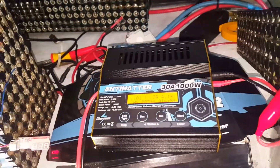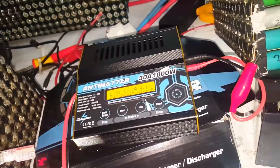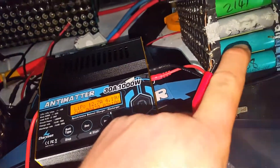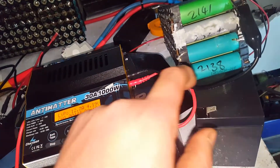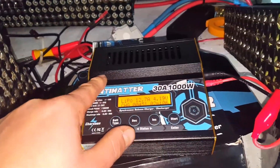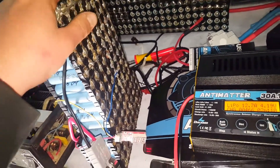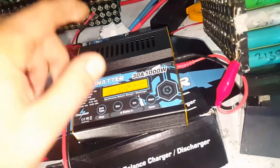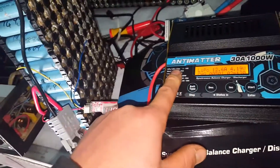I've been doing a bit of reading on how regenerative charging works. There's a regenerative discharging mode this beast has — it can pull power out of the battery pack you want to test, put it backwards through this unit, and feed it back into the power source, which is best as a lead acid battery. It gives you a discharge rating.